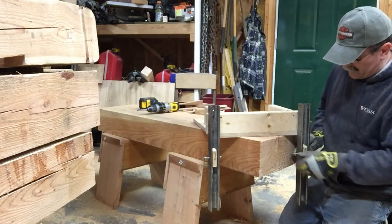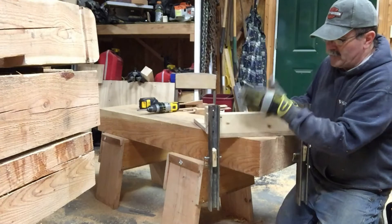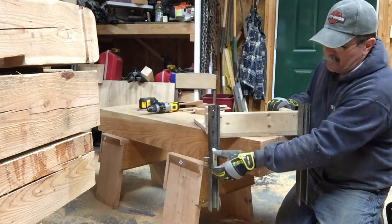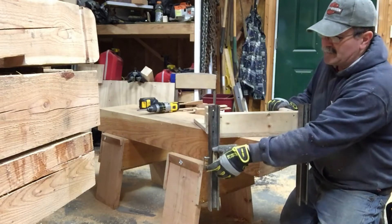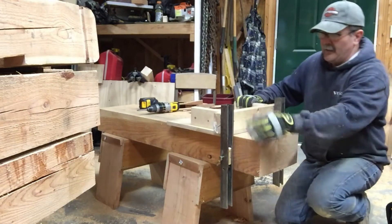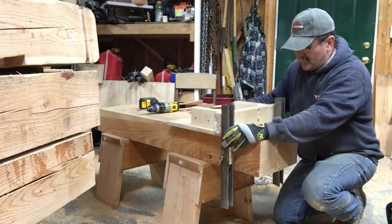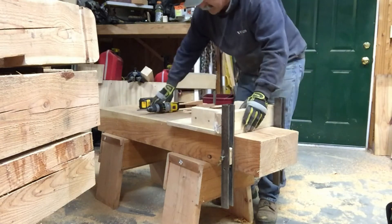Little hitch pins hold it in place. To set them, I made them a bit long, took a test cut, measured the depth, and machined off the end of the wood to make it the right height. It works from the top and from the bottom — a double-acting stop. I have a two-inch offset so I'm putting a four-inch tenon on here. I've got a line at six inches and we'll line this up with that line, nice and square — this will be the actual shoulder of the tenon.